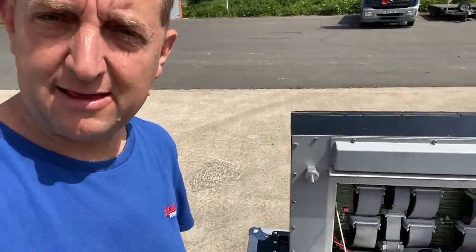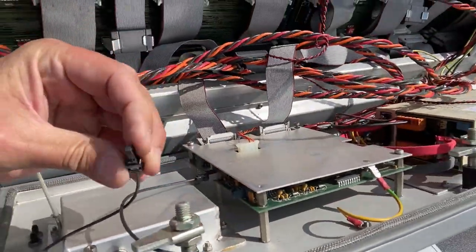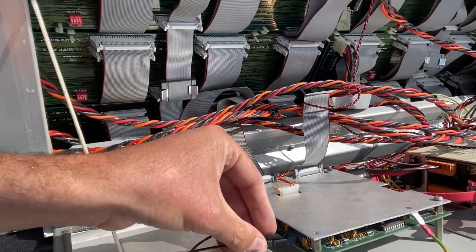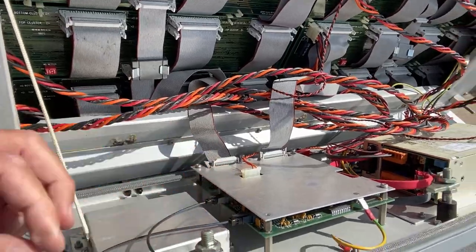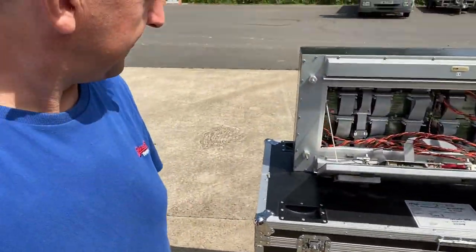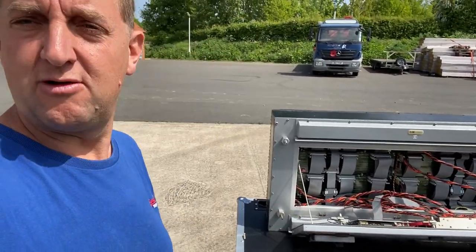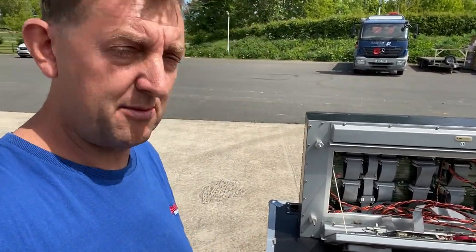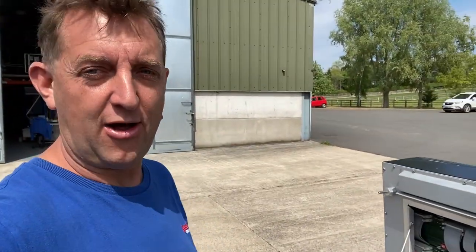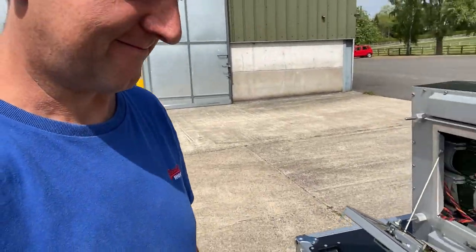Of course, I mentioned the fiber optics earlier. The plastic fiber optics you see here, that's what they look like. That's got a 1 millimeter core and just clips in there. This was also a very good way to avoid RF troubles, because of course you cannot get electromagnetic radio frequency emissions from a fiber optic cable, unless of course you count light as part of the electromagnetic spectrum. Yes, I give you that.